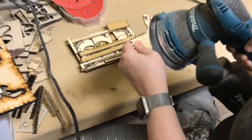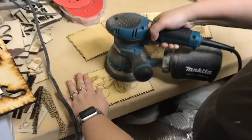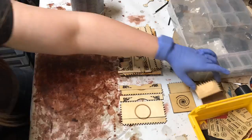When I do this, the glue doesn't stick to the polyurethane, but it does adhere to the freshly sanded wood, so I'll be able to wipe away any glue filler that I don't want and sand the rest of the edges smooth. When I'm done with all of that, I'll apply poly to the newly rounded edges, sand that, and then apply another coat of poly to the entire box for its final shiny coat.